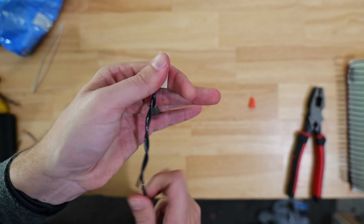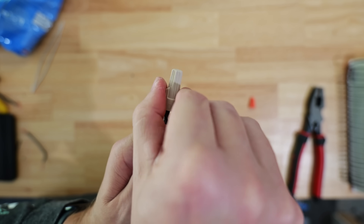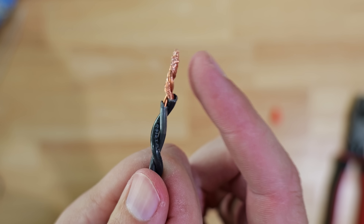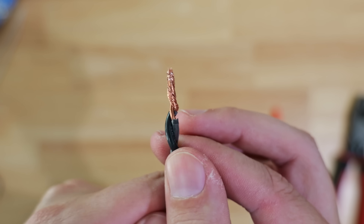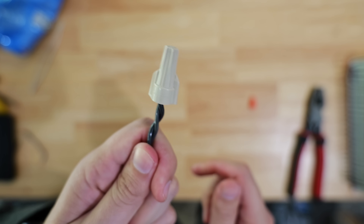We've got a nice winding going on down below the wire nut — there's just no way that wire is ever going to be pulled out; it's getting support from the winding below. When we take the wire nut off, this time the stranded wire is right up there as long as the solid core conductor, and it's also attempting to wrap itself around that solid core conductor. For the most part you will probably never have an issue with this connection.